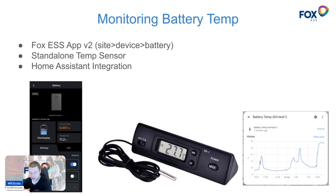There are potentially dozens of battery cells inside your battery depending on which model you have. The newer versions even have battery heaters built in, but we'll get to that. With dozens of cells inside a metal box, what is 'battery temperature'? The figure you see in the Fox app is typically the lowest cell temperature, and you'll have a slight variance of cell temperatures throughout the battery pack — sometimes a degree or two. The important thing to know is what the coldest cell in your battery pack is, because that is used by the Battery Management System (BMS) to determine what charge and discharge currents can be used.